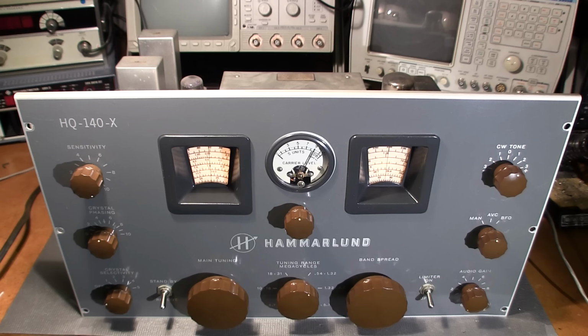So I guess, hey, we could actually test the dial accuracy at that point. That would pretty much tell us if the oscillator has been played with or how much that's moved. Again, a coil shrinkage and everything over time can affect that as well. So if it's way, way, way off, then we can pretty much say it might have been screwdrivered, but I imagine it's not going to be right on. If it is, I'll be extremely surprised.